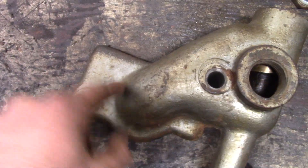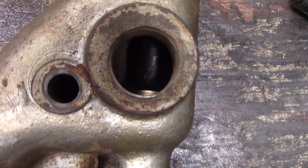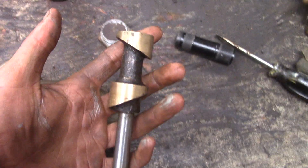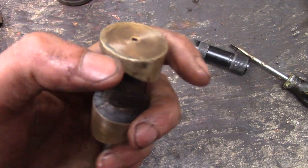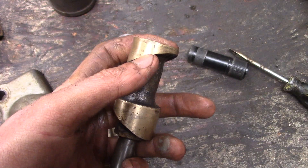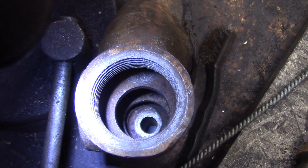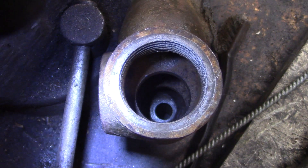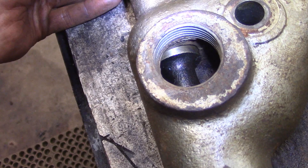This passageway here and this flange mounts up to the intake of the engine, as you can see there. You can see the gas valve itself right here — I'll slide it out so you can see it. And that's all it is. It's kind of like a diamond valve in a way. There are two valve discs and they're angled. Down in the housing, just past the threaded hole, there's one smooth round hole, and beyond that there's an identical size smooth round hole. The gas valve slides and fits perfectly right in there. Here's a look in through the gas port — you can see that brass or bronze gas valve fits right in there perfectly.